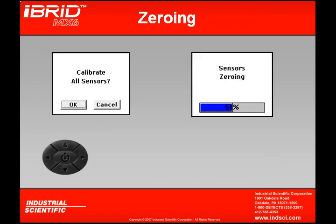The first thing the instrument will do is automatically zero the sensors. During the zeroing, it's going to take your toxics and your combustibles and set them to zero. We want to remember that whenever we zero the instrument, we do this only in clean air. If there are any contaminants in the air, that becomes part of the instrument's zero reference point and could potentially skew the calibration.